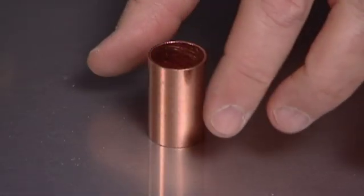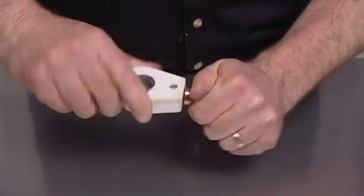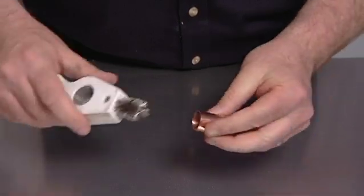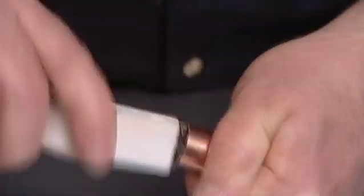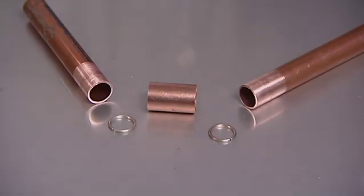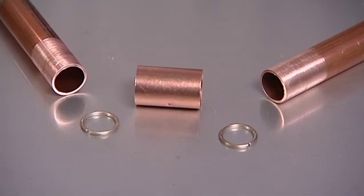The first step is to clean the tubing and the fitting. The parts should be properly cut and reamed to remove burrs. Cleaning should be performed so that surface contaminants are removed without unwarranted loss of base metals. Lightly roughen the tube ends and fitting with a wire brush, steel wool, or fine grades of abrasive papers. Any residual particles in the joint surface should be avoided, and any residue remaining after mechanical cleaning must be removed.